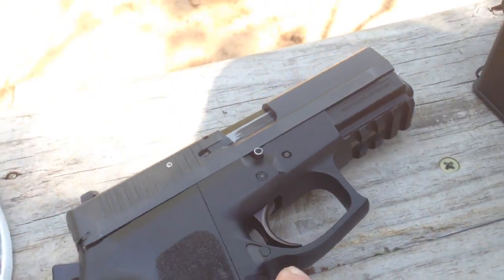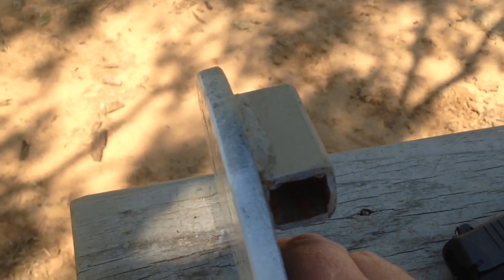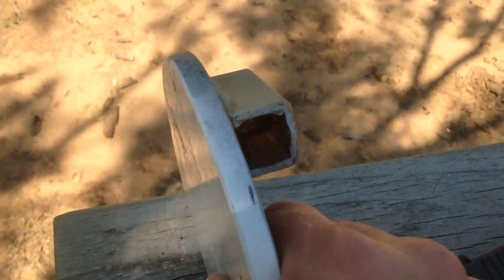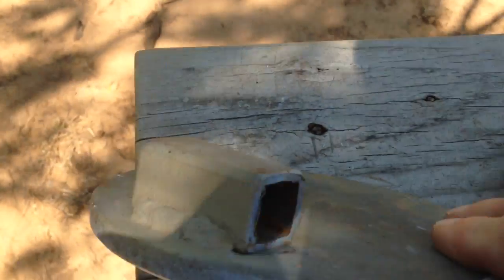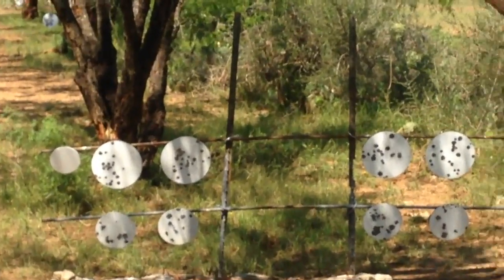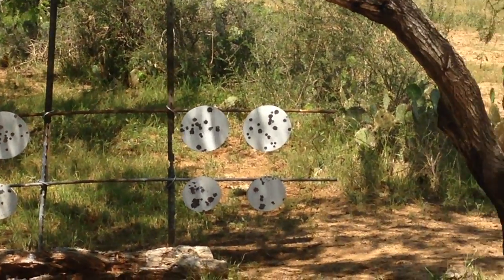To follow up on the targets: this is what they look like — a 6 inch target out there in the distance. The plates are three-eighths inch hot roll material — not hardened, not AR500 or AR400, just hot roll carbon steel. But three-eighths material withstands everything 44 Mag and less. We take a piece of one inch square tubing, weld it on, then slide that over the rail so when you hit it, it pivots and knocks the bullet down into the ground. My supports are just a couple of t-posts found on the property.